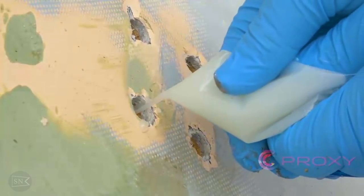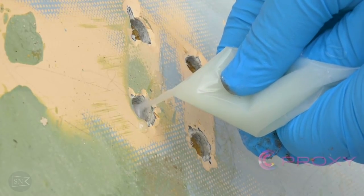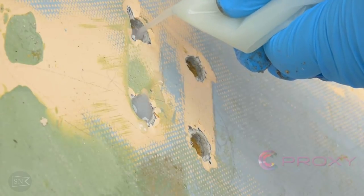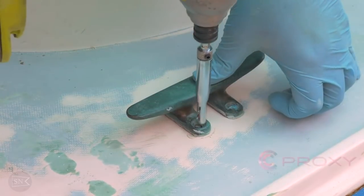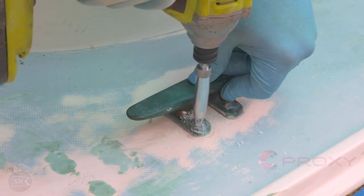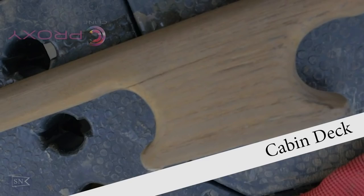Time to do something about this, but there were some challenges. In previous episodes you've seen me use thickened epoxy to fill in oversized holes, then drill out the bolt holes for fittings — this seals the deck and core and waterproofs everything, then I bed it with butyl tape to add additional waterproofing. This is great for securing things like deck cleats that are solid and rigid. However, handrails being made of wood have some natural flexibility in them, and the screw from the bottom to hold it was not really a strong connection.